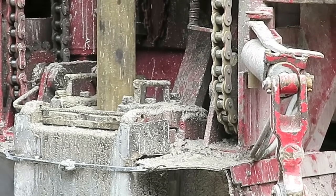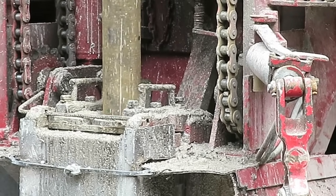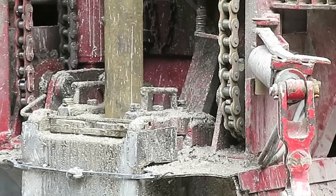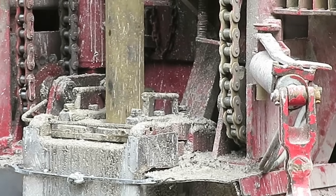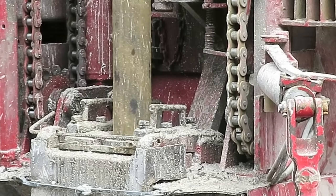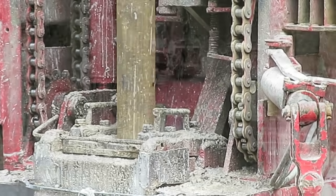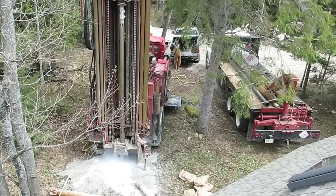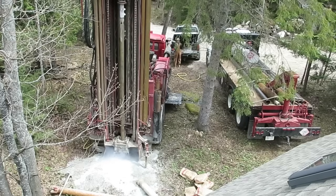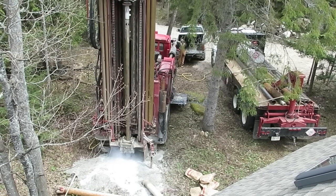Here's a closer view — look at the chain on either side. It's slowly inching down, and that's the rate of progress of the bit as it's going through the rock. It's actually dolomite, fairly hard as sedimentary rock goes, but this rig has no trouble boring right through it. From an elevated view you can see the dust kicked up by the air being forced down into the hole to drive the head.